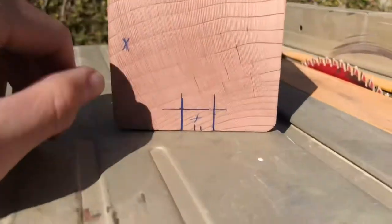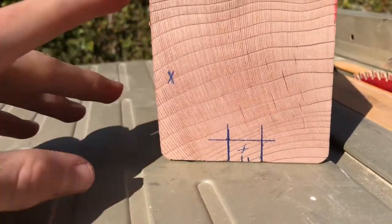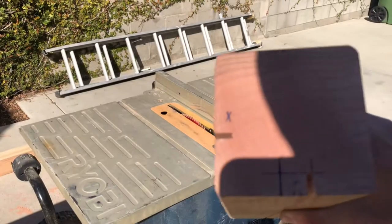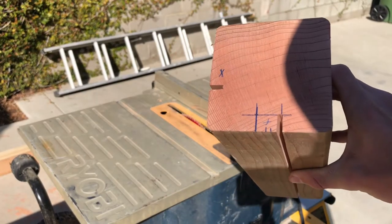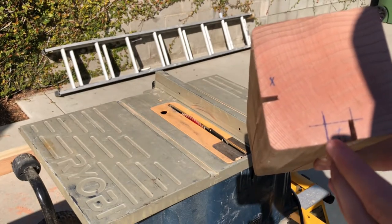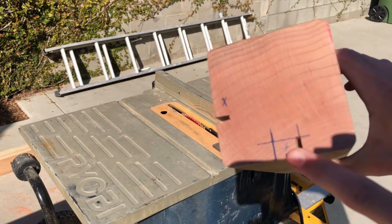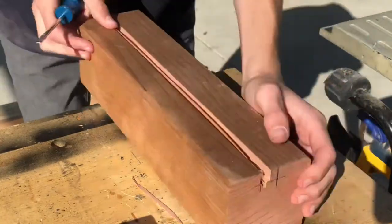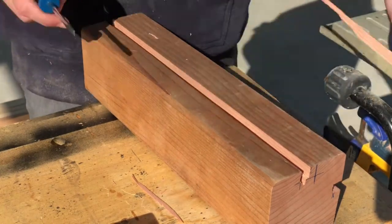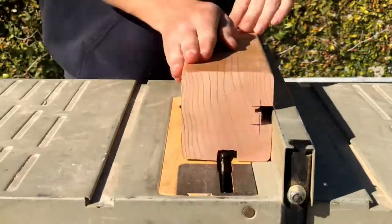To fill out the rest of the gap, you slowly move the fence over and over until everything is cleared out, and you'll do the same for the 3 other posts. Once the first part is cut out, move the fence over a little bit to get the next piece, and keep moving it all the way over until you're finished clearing these out. If my cut was a little too far to the right and left a thin piece of wood down the center, just use a screwdriver or a chisel to get it out. Then continue the cutting process for all the other pillars.